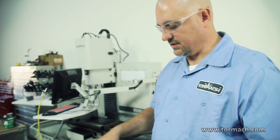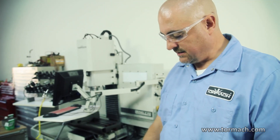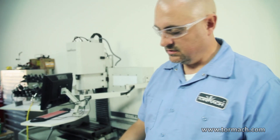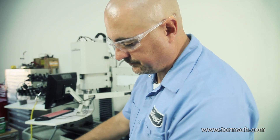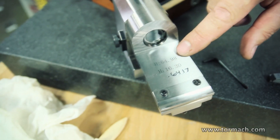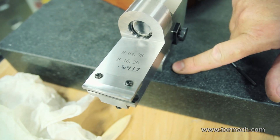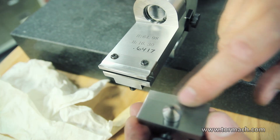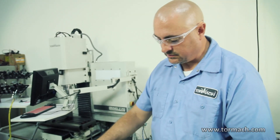Another way you can do this — this is just a quick easy way that I've always done it. There's another number on the bed here, approximately 65 millimeters. That's the number from the base to the center line. So you can take and set a height gauge to whatever radius you want from that number, and then just bump your diamond up against the height gauge. H is the distance from the center line to the bottom, and H1 is from the center line to the face. They're all going to be different because they etch these after the wheel dresser is manufactured.